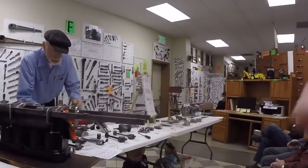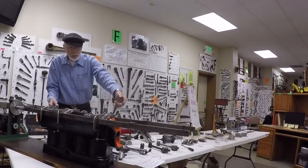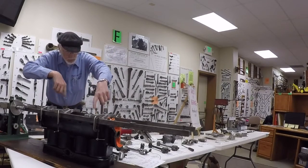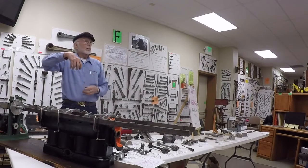If you're using the old KR Wilson machine, they have a thing they call a false cam that they put in the cam bearings. Then the bracket, which is all one cast iron job, goes down - it's got two arms that go down with machined surfaces. You slide them up against that false cam, then clamp it in place and bore.